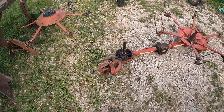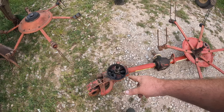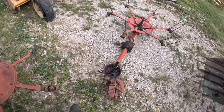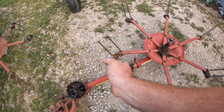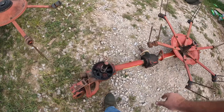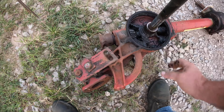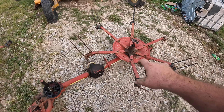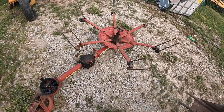Multiple people said just flip-flop end for end and it'll fix the problem — no, it won't. Because the bevel gear is in the same spot on both of them, and they're straight-cut teeth. That has absolutely zero to do with the direction they turn. All the direction of turning is right in here, because your bevel gear is on one side of your input shaft. If you flip it to the other side it should turn the opposite way, and that's what we're trying to do.